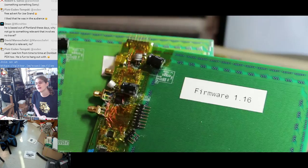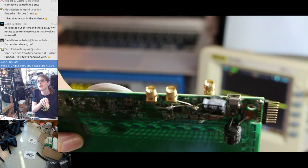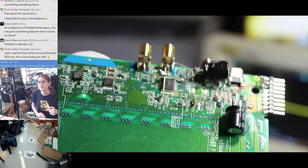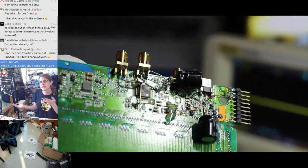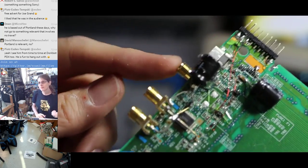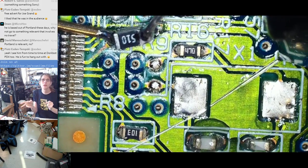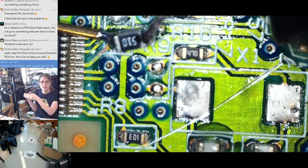And then going into the whole Face Whisperer thing, where it was using the ChipWhisperer's side channel power glitching, but combining that with timing data coming from a USB interface that's sending out test packets to try to grab the descriptors. The idea was, every time you plug in this device, it gives you a little bit of information out of that same ROM that the program is contained in, in order to identify itself. And by setting up the experiment just right, I can give myself a timing reference right where the processor is figuring out how to formulate the response to that question.